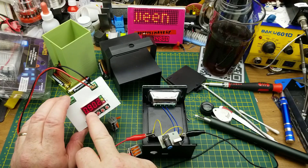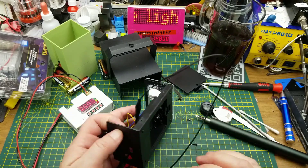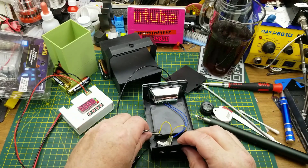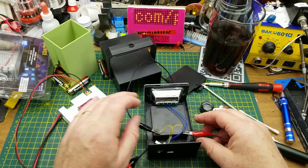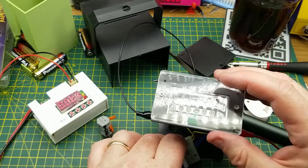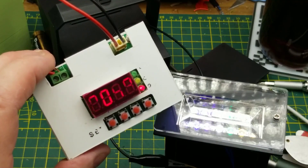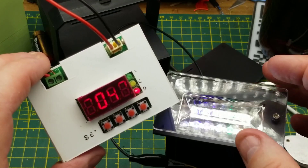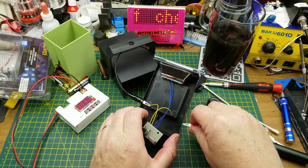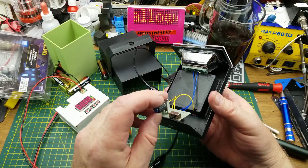Is it really drawing 900 milliamps? Oh, I've got the power on it backwards. Well, let's see if that microcontroller has reverse polarity protection built in, or did I just blow it up? Oh no, it still works - cool! Let's turn it up to full speed, which is basically indistinguishable from constant. It's drawing about 48, so let's say 50 milliamps - bugger all. Divide that by the five LEDs: 10 milliamps each, which means those batteries will last forever, especially when you've got it down to a lower duty cycle and lower speed.